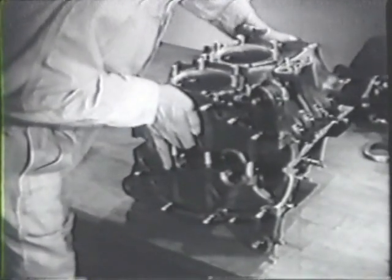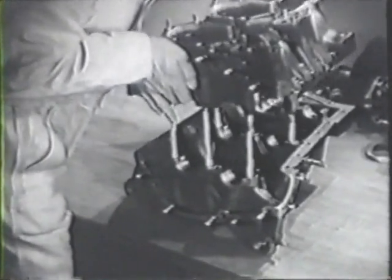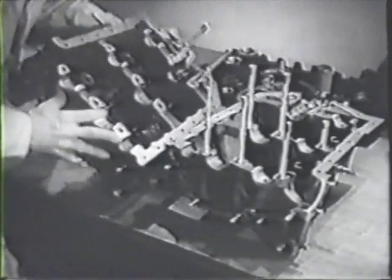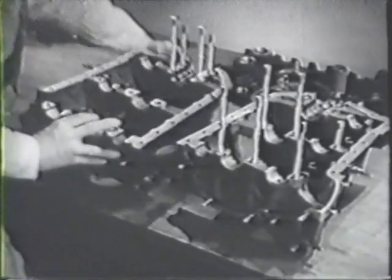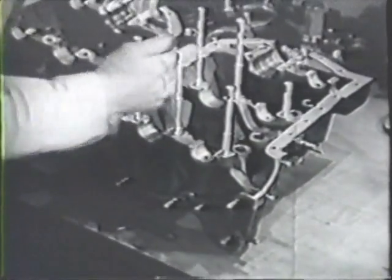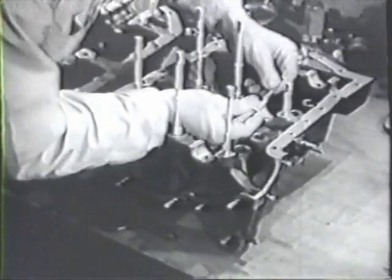After removing the nuts, take the two halves of the crankcase apart again so you can measure the hydraulic tappet guides. With a telescoping gauge, check the inside diameter of each guide.